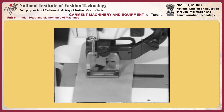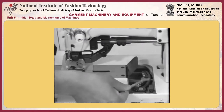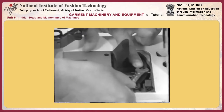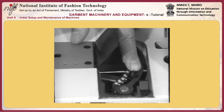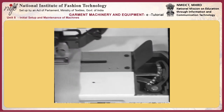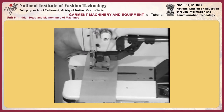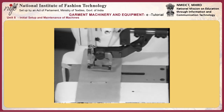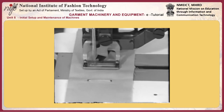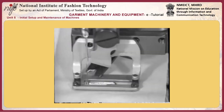Place the bobbin in the bobbin case and adjust the tension applied when drawing the bobbin thread out from the bobbin case to approximately 0 to 5 grams. Idling of the bobbin in the bobbin case can be effectively prevented by using bobbin case F provided with an idling prevention spring. Place the bobbin case in the hook, then adjust the idling prevention spring height so that approximately 20 grams tension is applied to the bobbin thread.